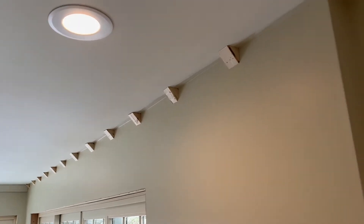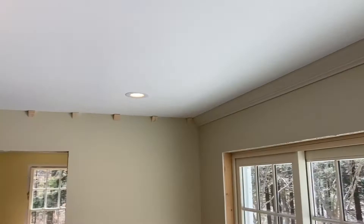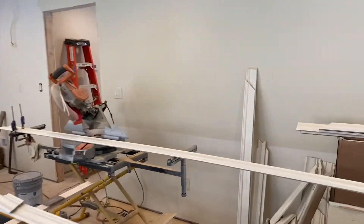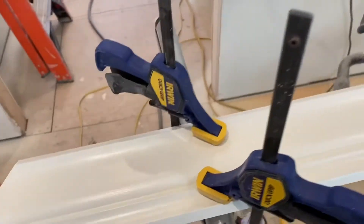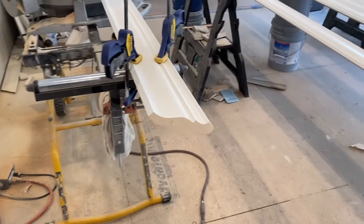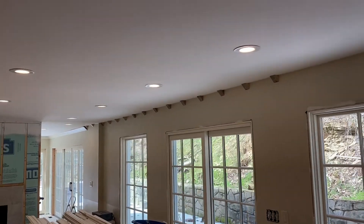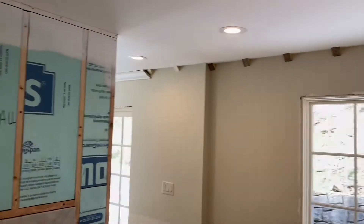Alright, so we got the other piece nailed in place and we got all our blocking up to do this side. Amber's outside taking a measurement on one of the lights out there. And we got some blocking up on this piece as well. Right now we're set up on the saw over here to go ahead and cope the one end. I'm going to cope the left end, so I've got it clamped to the roller support there on the miter saw stand. This end is going to get a cope joint, and then once that's done we'll go ahead and take it over, hold it in place, and see how everything looks. We've got an overlap joint over on this end here.